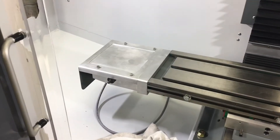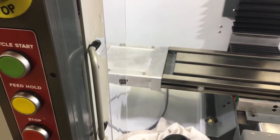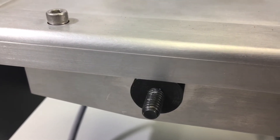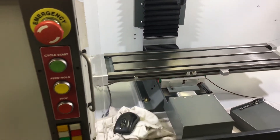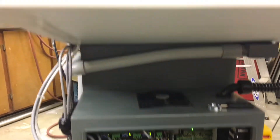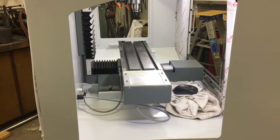The machine is sitting here idle. I'll disable it — it doesn't seem to make a difference. I'll bring you down here by the X motor. I'm sure you can probably hear this through the microphone — it sounds like the stepper is making a noise. Is that noise normal when the machine is not enabled? The drives have power to them so the light says drives enabled. Should those motors just sit there making that quiet buzzing noise? If it's something I should address or I'm not doing right, let me know.